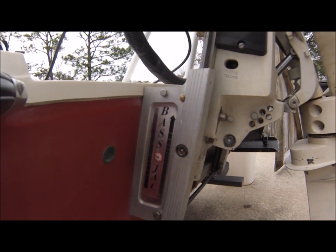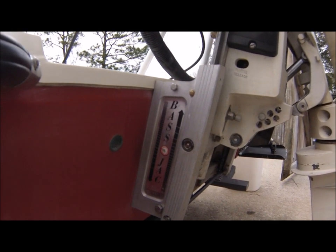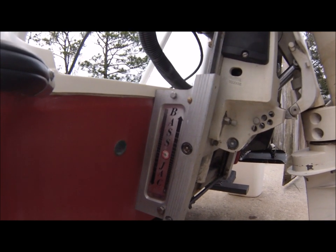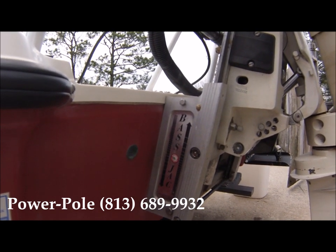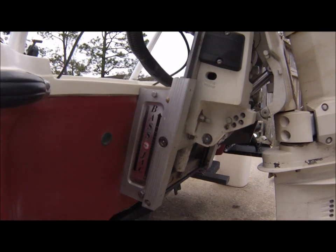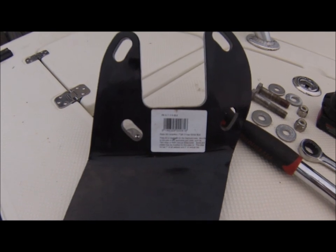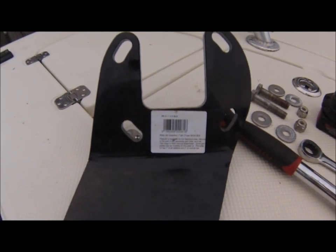As you can see, this is an older jack plate that is not pre-drilled and I'm going to have to drill two half-inch holes in the side of this jack plate to mount the power pole bracket. Pretty simple, but you need to have a template with your adapter. You're going to need to order an adapter from Power Pole — just call them up, tell them what kind of jack plate you have and that you need a bracket to fit your particular application. On this particular boat it's got a poling platform, so I've got to have enough rise to clear it. This particular plate is seven inches aft of the transom and has three inches of rise, which was perfect for my clearance issue with the poling platform.